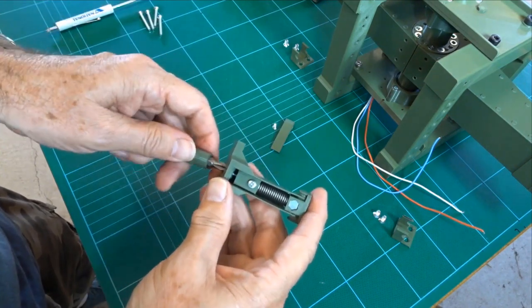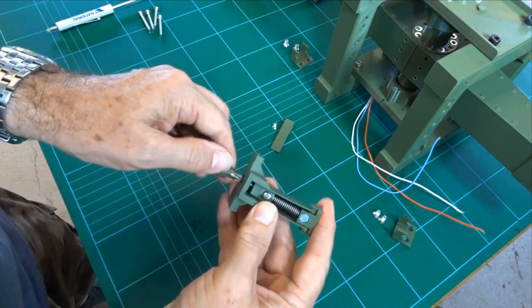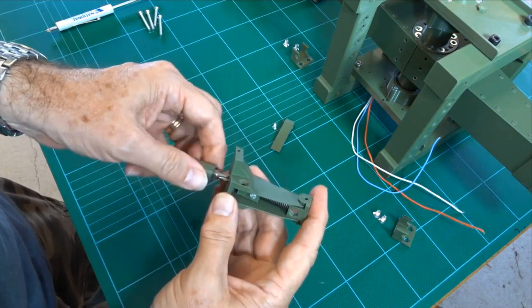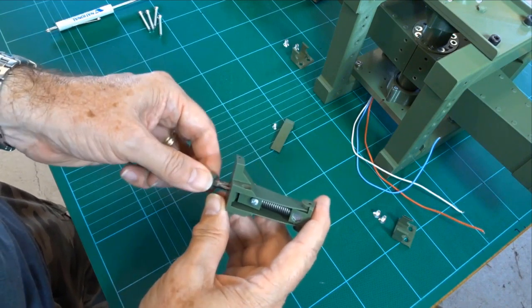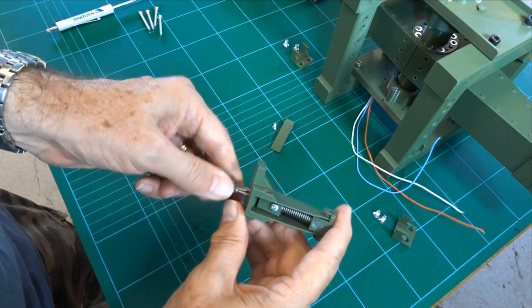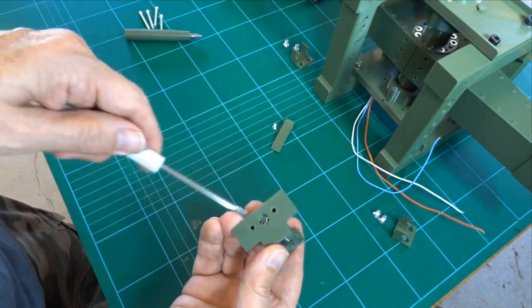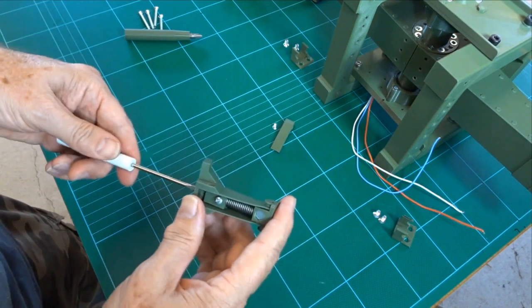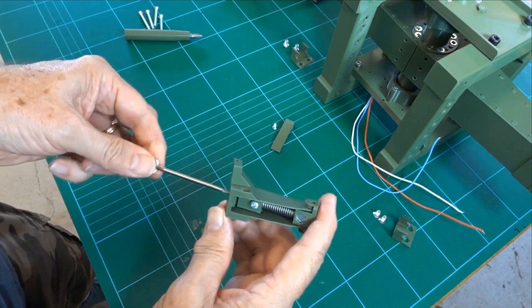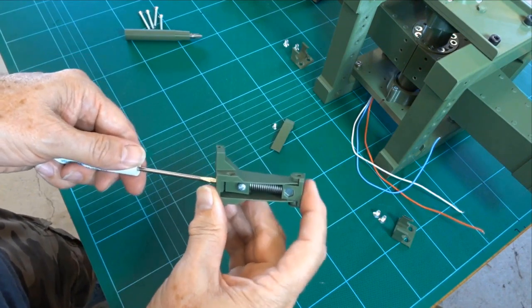So that just has to engage. Just push it down till that thread engages. Now you'll notice it screws down, there's no tension on it yet, and then it gets to within about a millimeter gap, roughly. And you use this screwdriver, works better with this nut. Gets down there to about a millimeter. Now it should be tensioned.